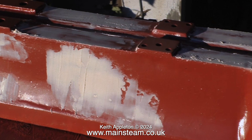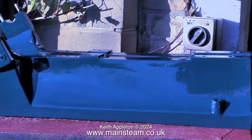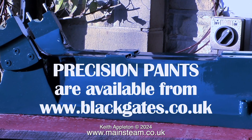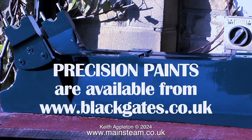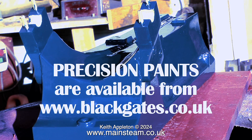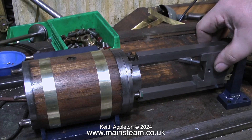There's only one thing for it — I'm using some stuff called knifing putty or cellulose stopper. This is not ordinary body filler, because it's never a good idea to put body filler over paint or primer if you can help it. This stuff is designed to fill imperfections. After rubbing down the cellulose putty, another coat of sprayed primer followed by painting the engine bed using Precision Paints Caledonian Blue. It now looks like a big improvement. I also painted the governor mounting in the same color. This paint is really good — once you finish, the brush marks magically disappear.